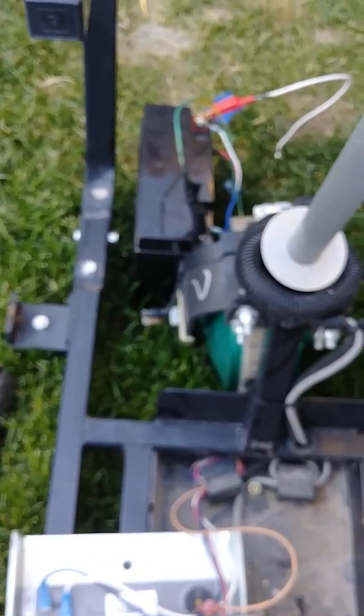At this point I'm pretty done with it, but I wanted to take a little time to mention: you can also disconnect the battery and check resistance on the wires to make sure there are no broken wires, because this thing moves up and down the aisles constantly and a wire could be broken. I wasn't getting voltage transferred from one point to the other, though — I had voltage here but nothing here. And this is just the horn switch over here, and this other one I'm not sure if it's for a light or something else.